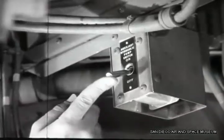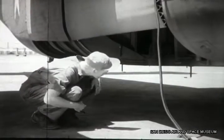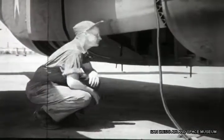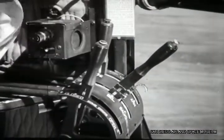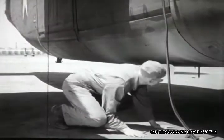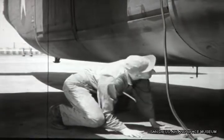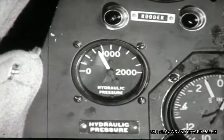The principles of the bomb door system are naturally the same as the flap. To start the inspection, Williams flips on the auxiliary pump switch in the bomb bay, then going to the bombardier's compartment, he waits for a signal that everyone is clear of the bomb bay doors and places the bomb door handle in closed position. As the doors start, Duffy checks the indicator light on the panel — it goes out, as does the light on the tail. Chandler makes sure the doors close completely. During that last operation, Duffy checked for normal pressure again, and at the instant the doors closed he noted the kickout pressure point.